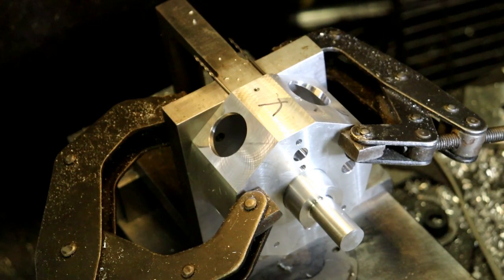I'm walking around here looking on my rack. I've got 5/16, all kinds of 5/16 hanging in my rack. Well, I'm just going to have to drill it and ream it for 1/4 inch, and then I hate to go oversized. Now you can't silver solder aluminum, and I don't have a TIG welder. I wish I did.